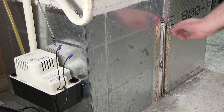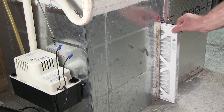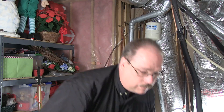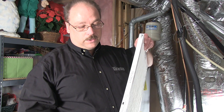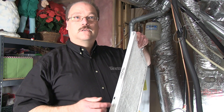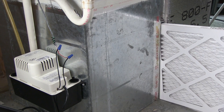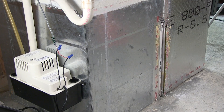Now to change the filter, you simply tear this tape off and pull the filter out. Sometimes it's easy, sometimes not. Take this — if this is a dirty filter, you would throw this away. You take the new filter and you always want to place it where the arrow goes and faces the furnace. The arrow always points to the furnace. So you put the filter back in like so.